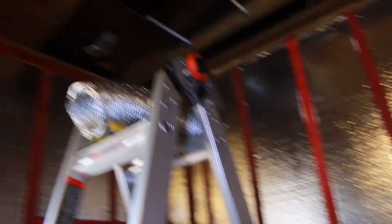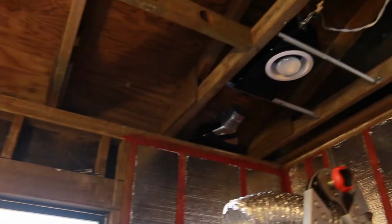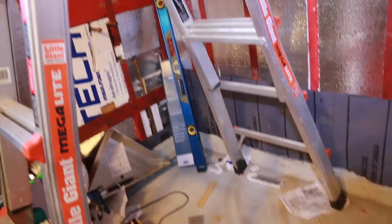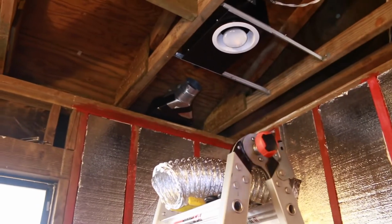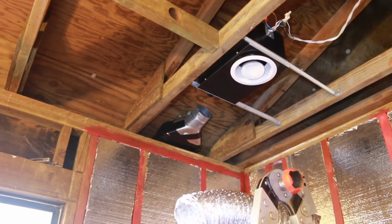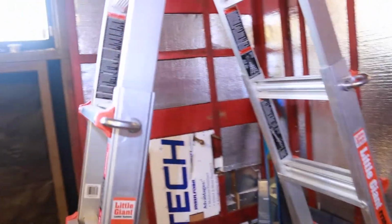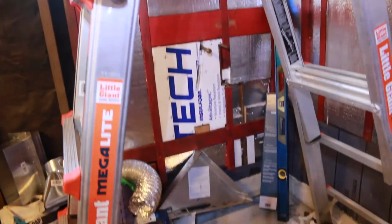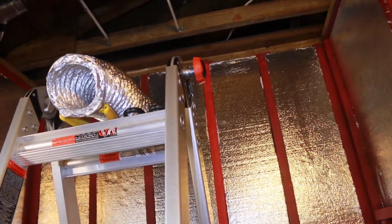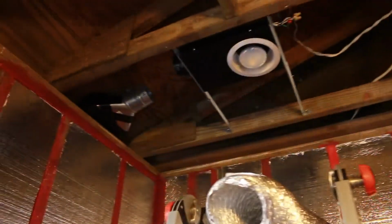And the reason I did this is because we have a lot of silt and sand and dirt in the area and a lot of wind that comes in on this side. So I wanted to make sure that the bath shower did not fill with sand and silt or cool air while you're in here. I just wanted to make sure I didn't get any backdraft sand and cool air coming into the bathroom. So it's a little bit of an overkill, but all the doors open easy, and so it's not going to be an issue. If you have a door that's hard to open on any of those 3 points, it's not really going to work out. So later I'll get the shower niche in, and I'll get the vapor barrier in, and I'll get the backer board in, and then we'll get moving.